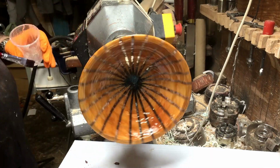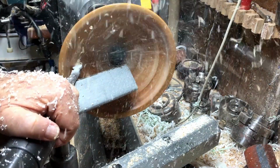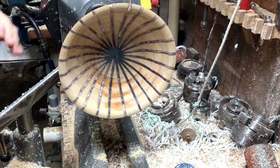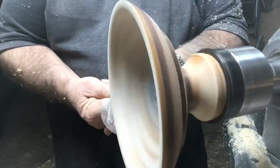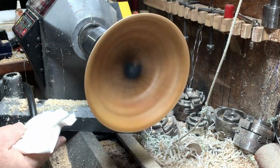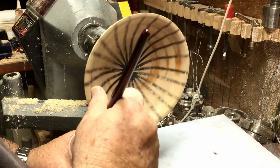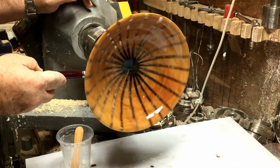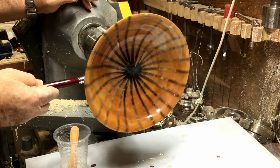And now I'm going to put gel resin again, so I can close the rest of the holes, and the next morning I just clean the excess resin and prepare it for the last and final finish. I'll start sanding from 120 this time all the way to 600, and after that I'm going to clean it properly with alcohol, and put another layer, but this time of the normal resin that I use. I'll brush some resin on. The resin is from Art from South Africa, and I'll let it stay overnight, and hopefully in the morning it will not bubble or anything like that.